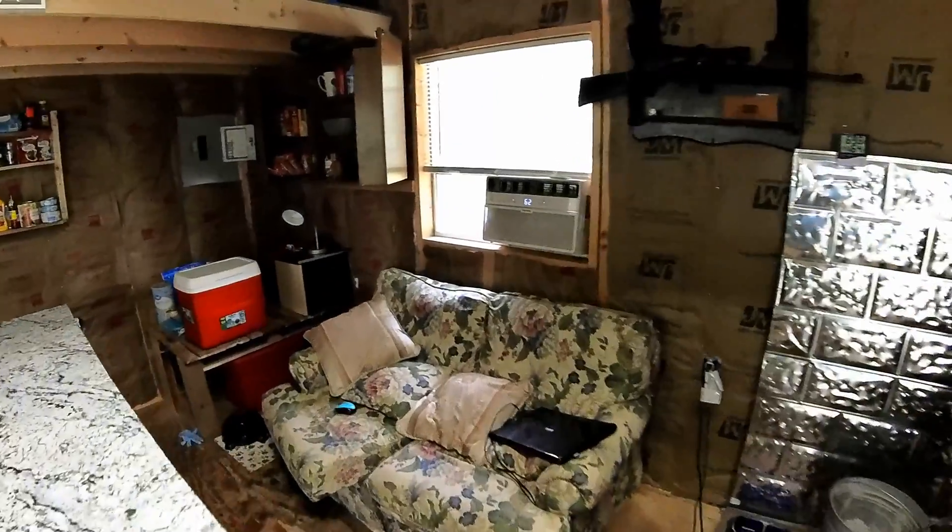Now this is just a little 8,000 BTU air conditioner. You could put a 10,000 to 12,000 BTU in here, but there's no need — this is a 12 by 28 little tiny house and 8,000 BTU is plenty. Even if you had a bigger house and needed a bigger air conditioner, you could use a solar system like this to run it in the heat of the day. When we get into the night, it's a different story — unless you have a large battery bank, I don't have a large enough battery bank to run this all night long. It'll run everything else all night long, but the air conditioner — no, it's not going to run that all night without draining the batteries after about six hours. Completely off the sun.